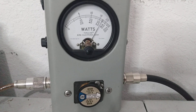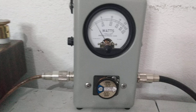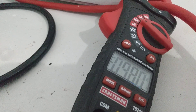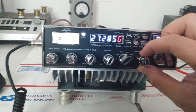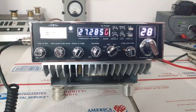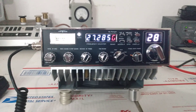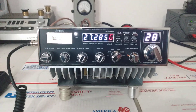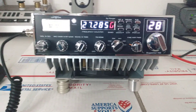Check audio, one, two, three. We'll go wide open on sideband — still showing 700 watts PEP. But check this out: over 300 average. Now check out the difference in the amount of current it draws — over 50 amps, just like on AM. So we've got some good balance there. The power drawn on AM and sideband is about the same. With it not properly tuned, you noticed it was drawing 30 amps versus 50-plus amps but showing the same wattage on the meter. That's why I highly recommend — even if you don't get a radio from me — get people to show you the average power and the peak power. If you've got a radio doing 100 watts average and 800 watts PEP, something's not quite right. You're not going to be getting the best performance out of the radio — you want to see a good amount of power in both.